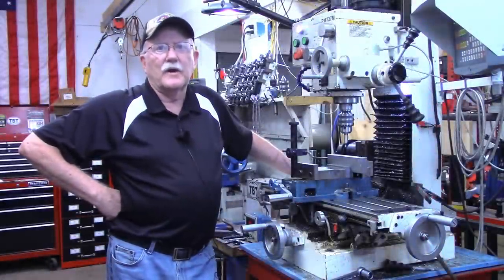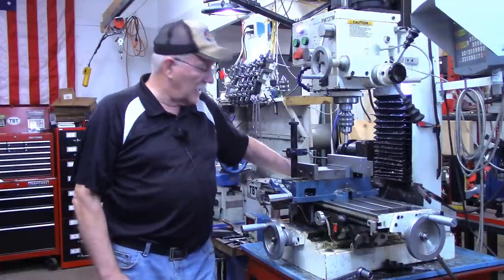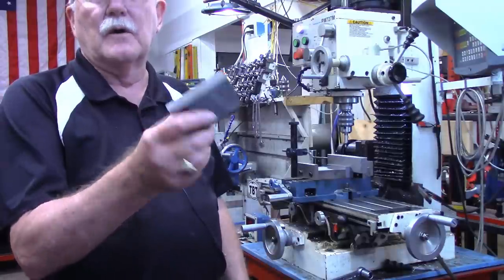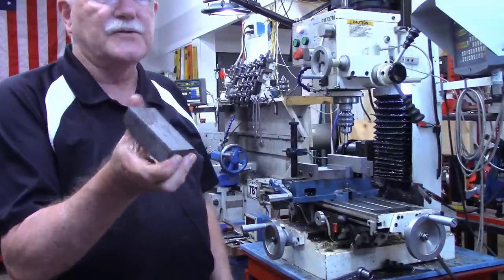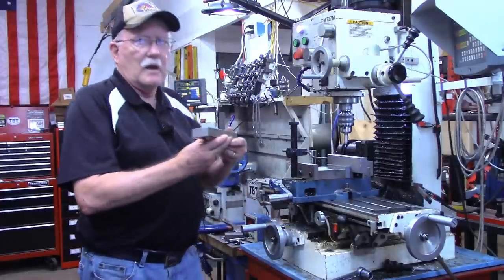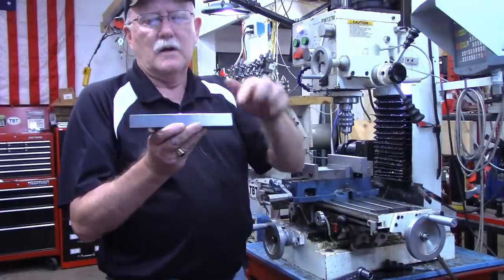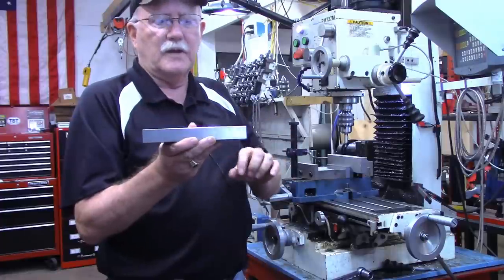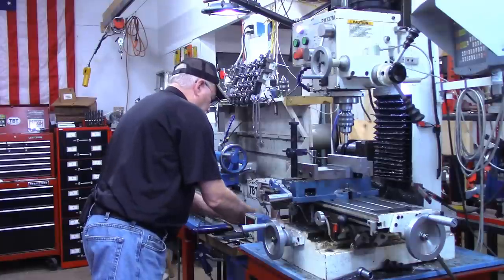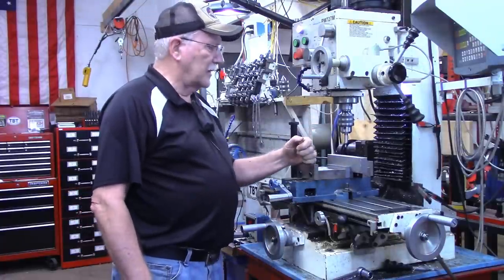Hello and welcome back to the Tin Barn. I'm Pragmatic Lee, and in this video we're going to continue our build of what's called the two-piece mill vise. In the previous video we took some hot roll that had been sandblasted to remove the mill scale, milled it down, cut it to length, surface ground all four sides and two ends, and put a chamfer on it. That video was all about material prep. What we're going to do today is take these pieces and turn them into a vise.